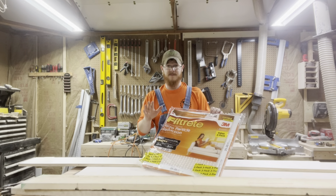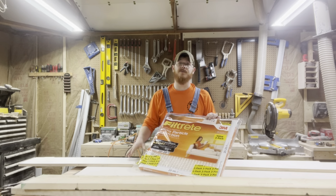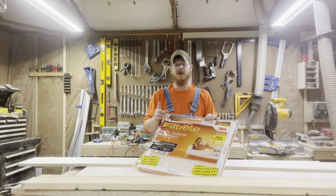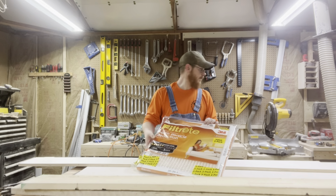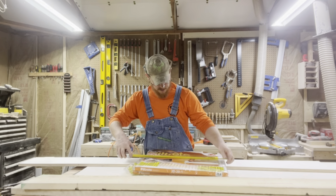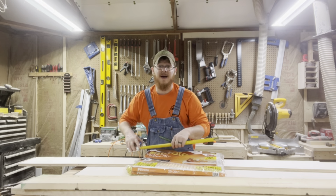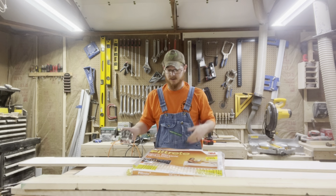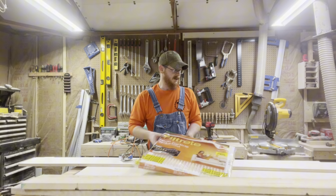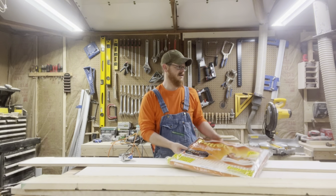So be mindful, if you go do this project, if you go get you a split unit and you're making a filter box and you're going to put filters in it, buy your filters before you make the box. Because they say 20 by 20, and in actuality they measure like 19 5/8. I guess it's like lumber. It says 1 inch and it's 3/4. But just be mindful of that. Buy your filters before you make the box.